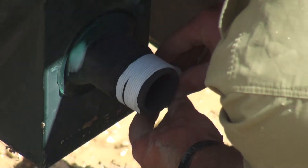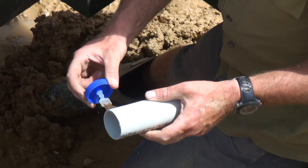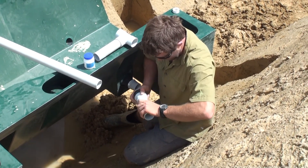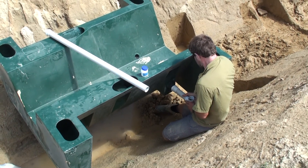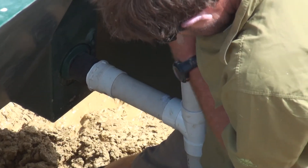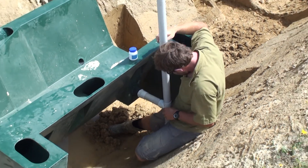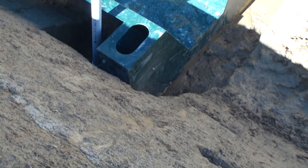We plumbed the PT into the moulded intake — one on each side of the flume — and just bunged up the opposite side. This is ideally suited for a small stilling well on the side here, which would give the best accuracy. We can also use ultrasonic or radar hanging over the top pointing down.